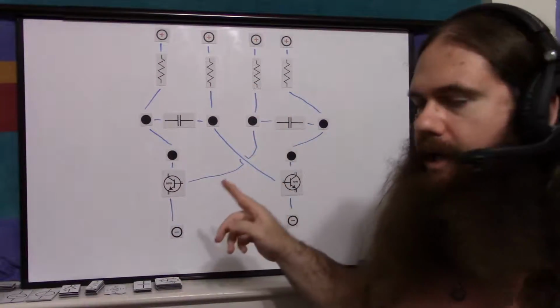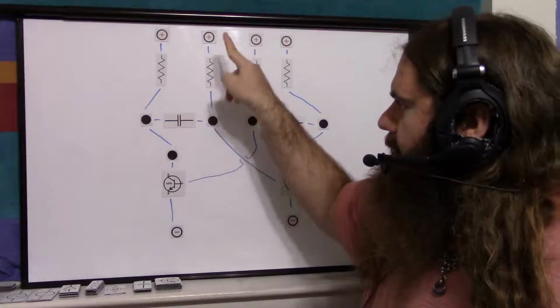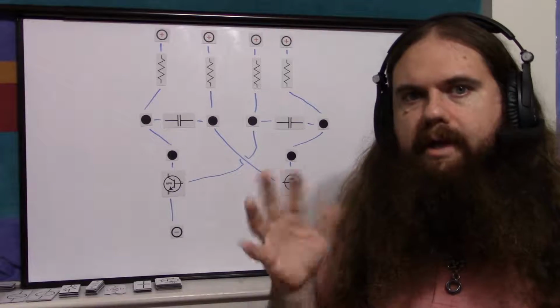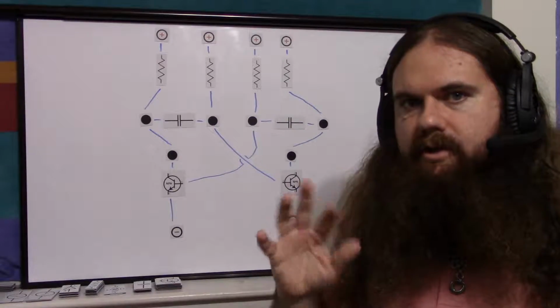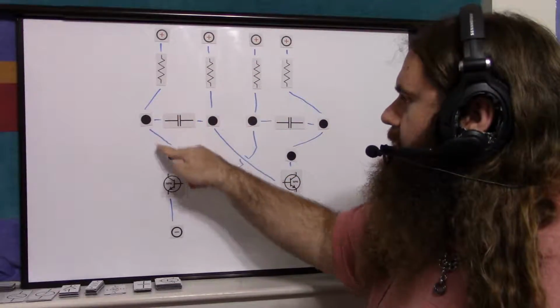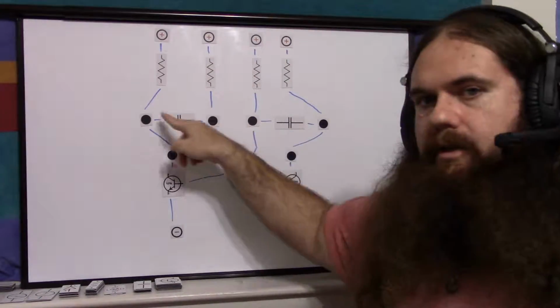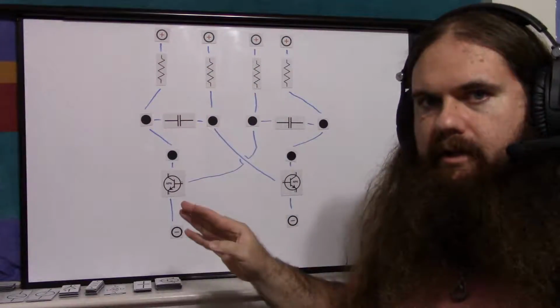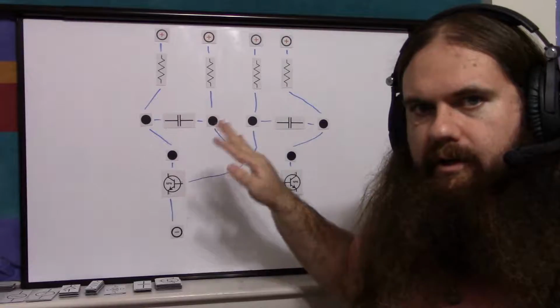The actual timing is this resistor through the capacitor discharging. Remember, the RC network timing is both ways. It's the same time constant charging and discharging. So we want the primary timing to be as it discharges this way with the load on. And then when it starts charging, we want this to be fast and quickly turn the load off, as well as make sure this is charged so we're ready.